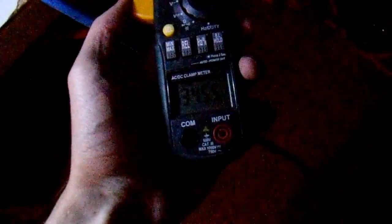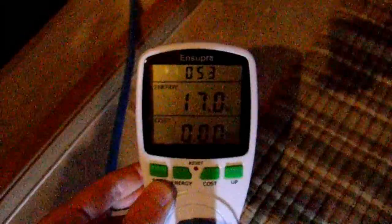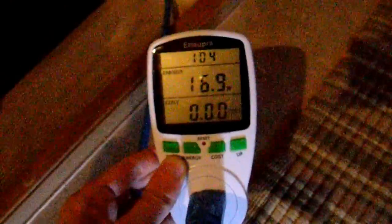Let me turn on my light in the garage, which doesn't seem to work for some reason — I'll have to look into that. Let's take a look at what the inverter is drawing, so I'll switch my meter to DC. It's drawing 34 amps, which means I'm drawing about 350 watts. It appears that for some reason my arc fault breaker tripped when I turned the inverter on. I don't know why, but after I reset it everything seems to work fine.